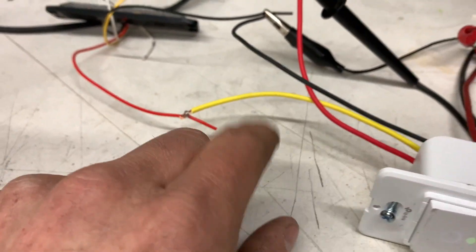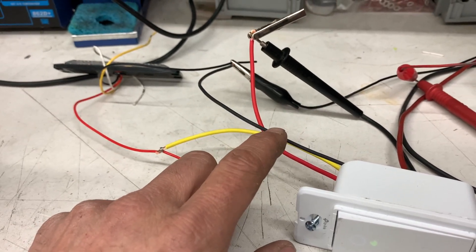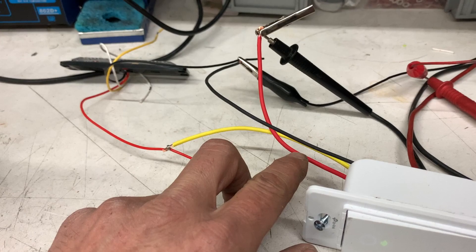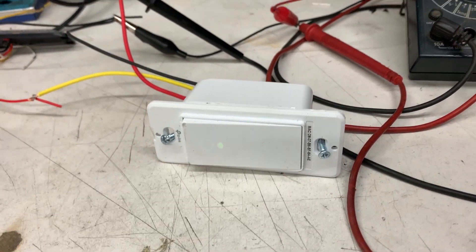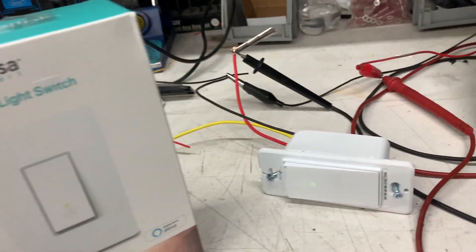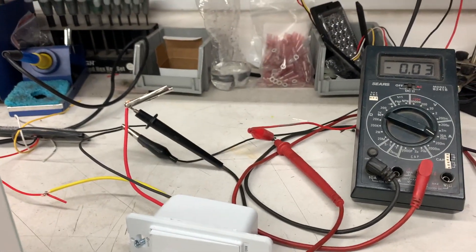While it fires up, I'll explain: we have three wires coming out. I changed the wire colors so I can understand what's what when we install it. The black is your ground, the red is your 12 volt power coming in, and the yellow is 12 volt out. It's still showing the Wi-Fi symbol, which means it's still firing up. These switches are great, and now that we can modify them for low voltage they're even better — you could use them in trucks, cars, RVs.